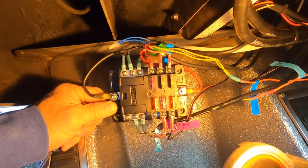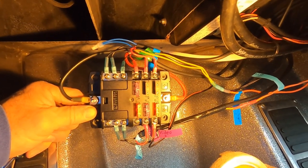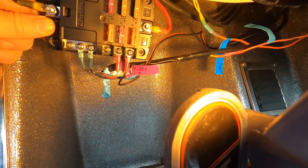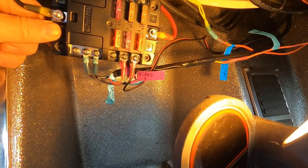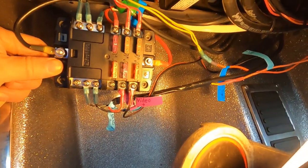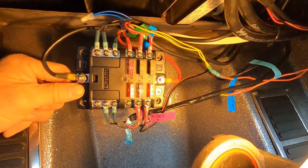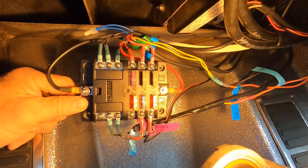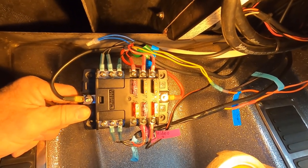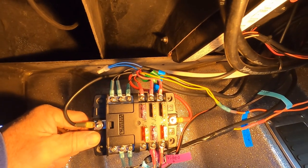Okay, I got all the wires landed on the terminal buses there. So both active targets and my video camera wires, my SS3 Structure Scan 3D, all there. Put in 5-amp fuses for each of the active targets, and I've got a 3-amp fuse for my SS3D and also for my HDS12 that'll be running back here. And now I'm going to go ahead and attach the fuse block up against my console, and then I'm going to tie wrap the cables and protect them, and all the wiring part on this side will be done.